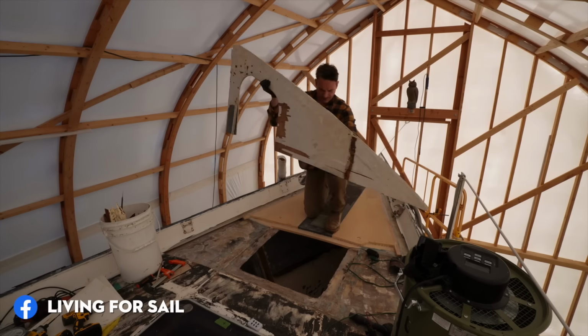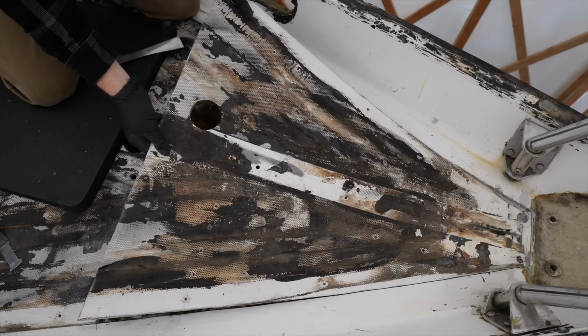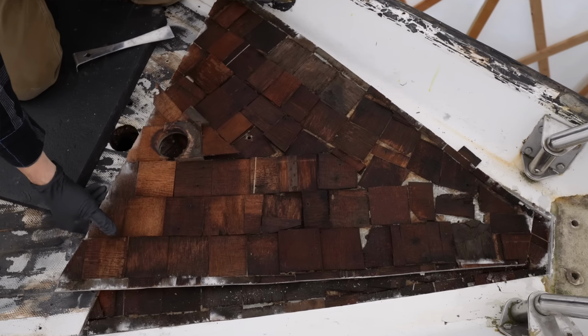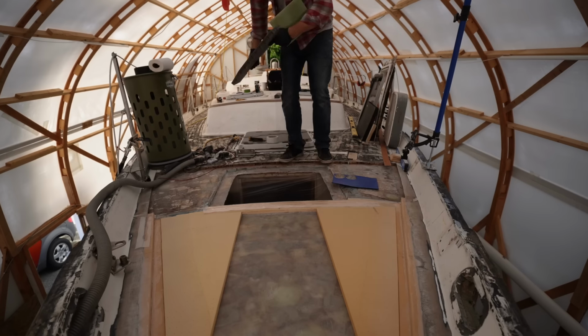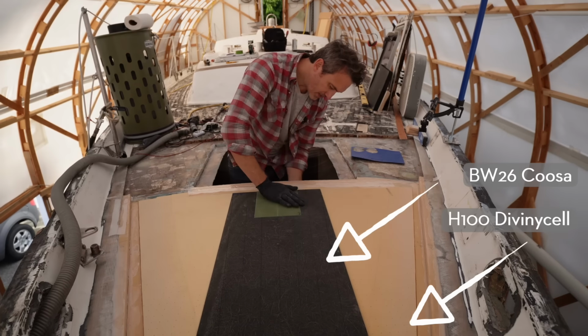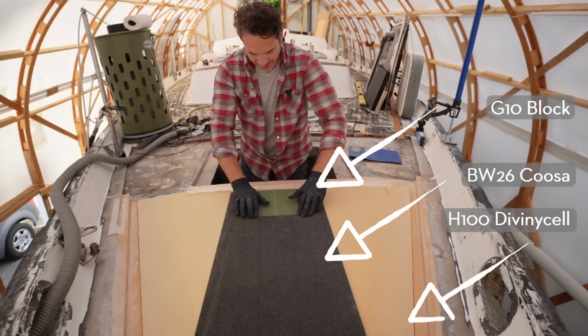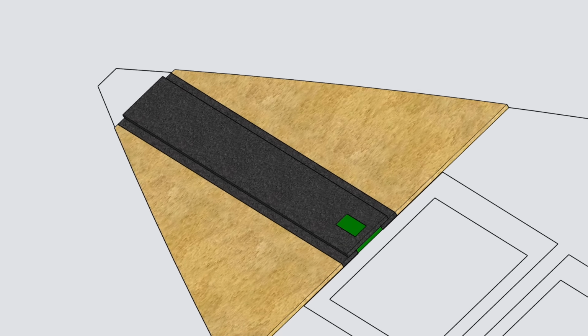And what I want to do today is lay some fiberglass up overhead. We're going to be replacing most of the core on this sailboat, probably all of it. And we started up here at the bow where we had some plywood and balsa. Now as I replaced it, I put in a couple of different materials because I wanted to get a little bit more strength on the center line where I'm going to have my windlass mounted and the staysail fitting also mounting close to here. Now I want to avoid really high stress concentrations where the material changes from balsa to foam, for example.